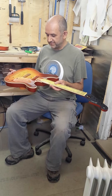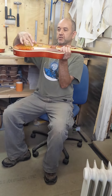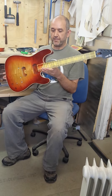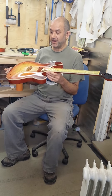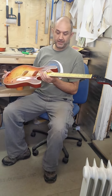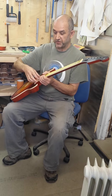So there are a few little details, things that we do. We're super picky about the neck angle so that the bridge isn't too high. We're also super picky about joinery so there aren't any gaps. Everything fits tight — 100% contact when anything is glued together, including little things like binding, the bottom of the nut, truss rod, and fillet.